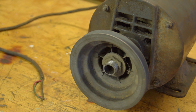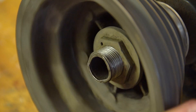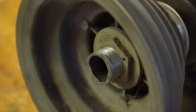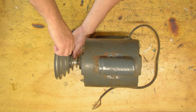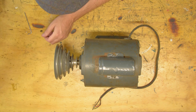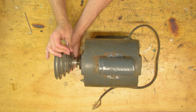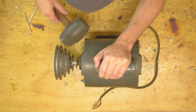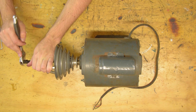Welcome back. I'm going to refurbish this Canadian General Electric single-phase motor. First step is to remove the pulley. Clearly I won't be unscrewing this nut that someone has mistaken for an anvil. That shouldn't matter though because it looks as though it is just part of a two-piece pulley. The shaft out of the motor will be a keyed press fit. It's always worth a little tap just to see if this will be the first ever occasion that something just slips off. A gear puller easily dealt with the pulley.